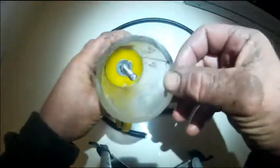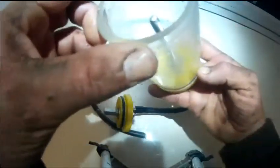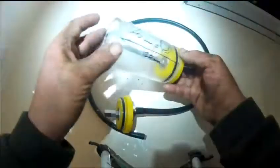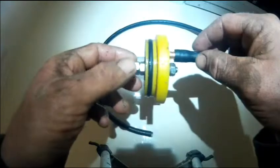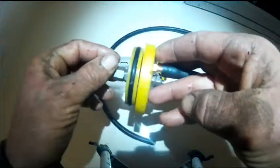Results — you can see this acrylic is pretty thick, so it definitely survived 25 bar. Quite a large, long piece — it would be longer than probably what we'd use in the real run. I've seen some new end caps coming on. Let's make them with closer tolerances, new O-rings, and then do another test next week.